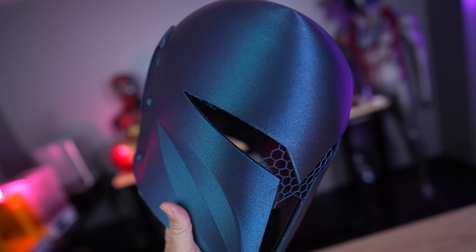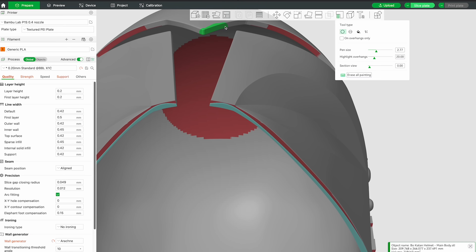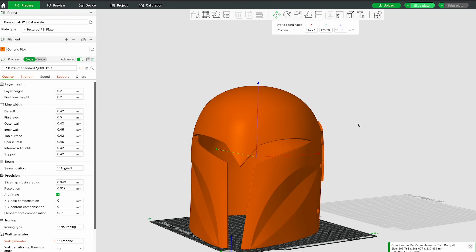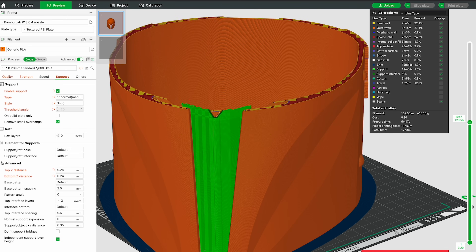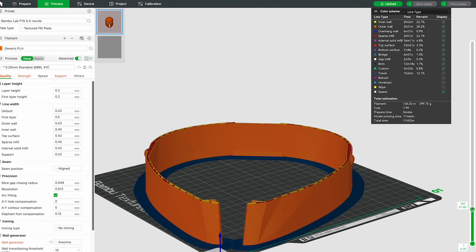What I'm talking about is this hexagon-shaped pattern they've included that's going to allow it to print more easily when you have this little crest shape — the center eyepiece you see in Magneto helmets or in these Mandalorian style helmets — where this typically has to be supported from the base all the way up. It's one of the critical failure points I've run into over and over again when printing these styles of helmets. What they've done is built directly into this a honeycomb-shaped pattern that's going to help bridge the print as it's running through and printing this.